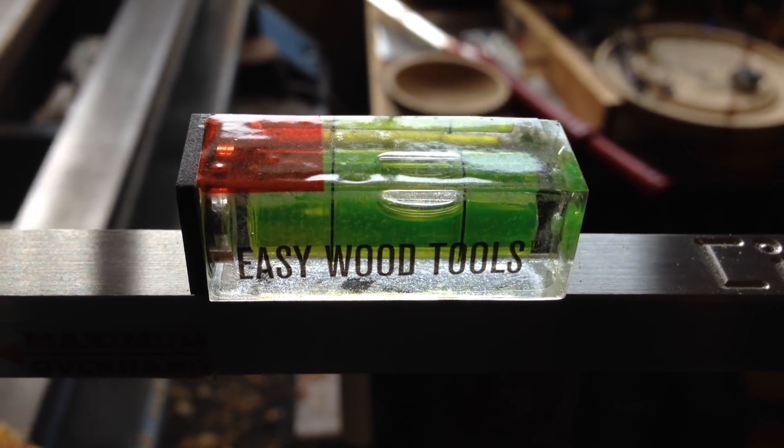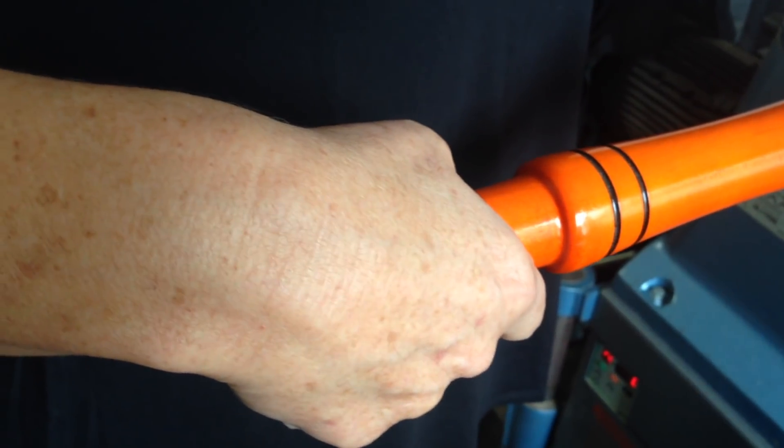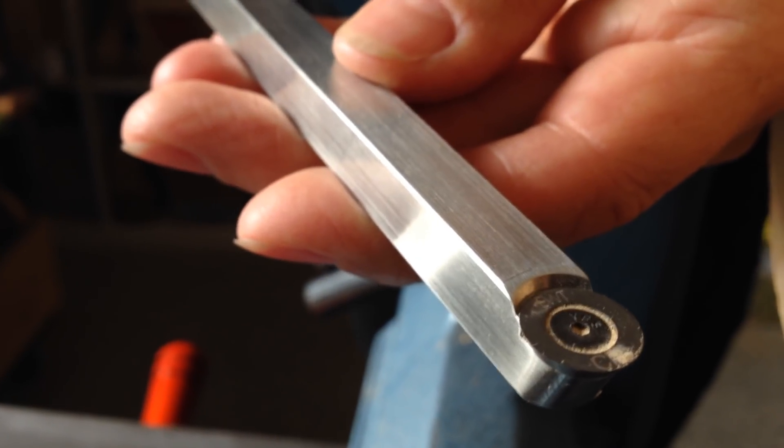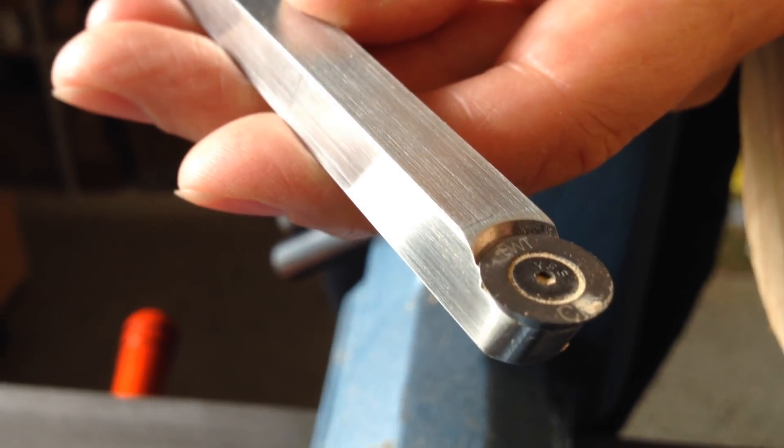What I haven't mentioned yet is that all the tools are cut away at the end — that's to encourage the user to hold them at the back, which gives you more leverage. The Easy Wood Finishing Cutter is fantastic, with that round cutting edge which I made full use of in my bowl. And the detailer — I love it. I'll be using this a lot on the finials and candlesticks I make, for beads and coves and finer work. Last but not least, I didn't have to sharpen any of my tools today. I found the Easy Wood Tools effortless and easy to work with. Thank you for watching.